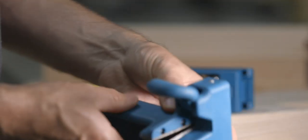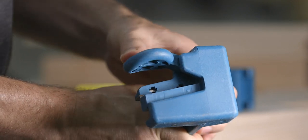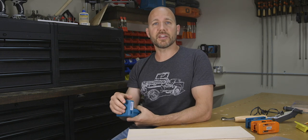The last trimmer is called an end trimmer or tail trimmer. This tool works really well at trimming excess material that overhangs the end of the plywood. It isn't a hundred percent necessary to own, especially if you're only doing a few projects, because there is another way to trim the tails — I'll show you that in a few minutes.